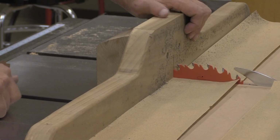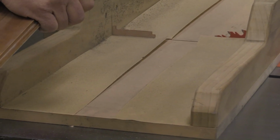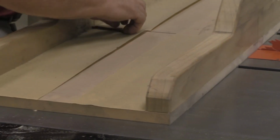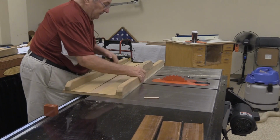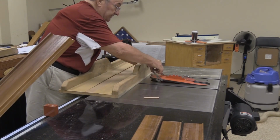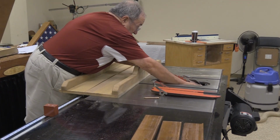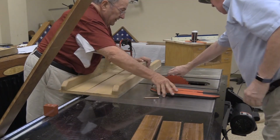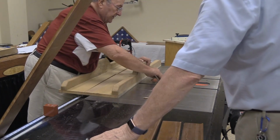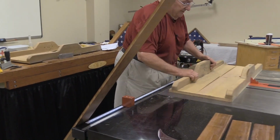What's the angle that you're cutting? Okay, Larry, you want to grab a hold of that? Stop. I discovered here that I'm shutting off the SawStop, for those that are curious as to what I was doing. The riving knife is creating too much interference here because I haven't got clearance for it. So I'm going to pop the riving knife out. It's requiring more oomph than I can deliver today. There we go.